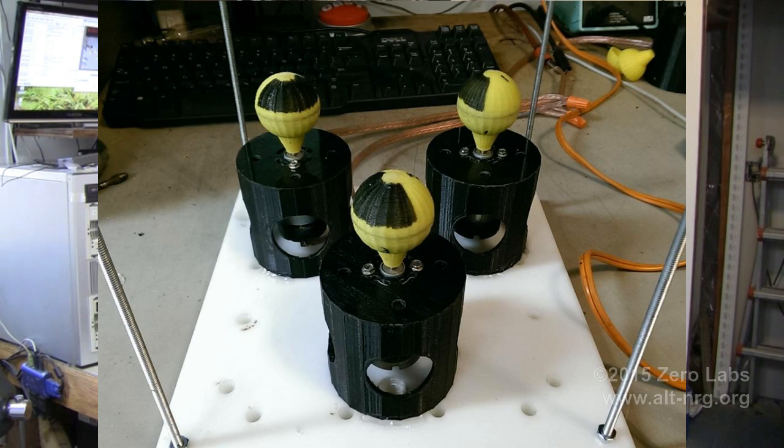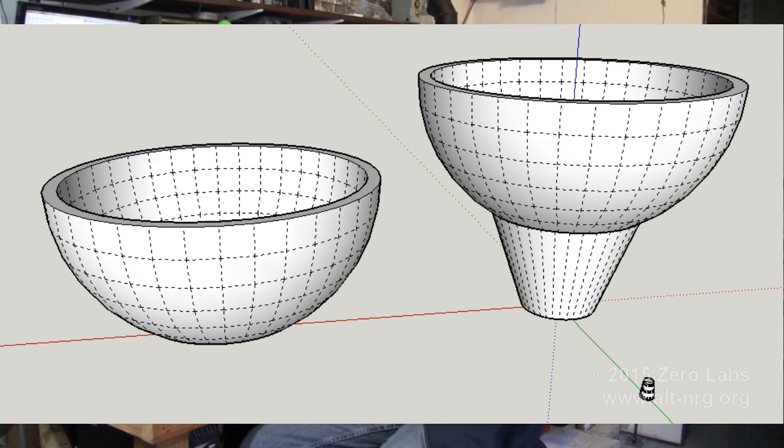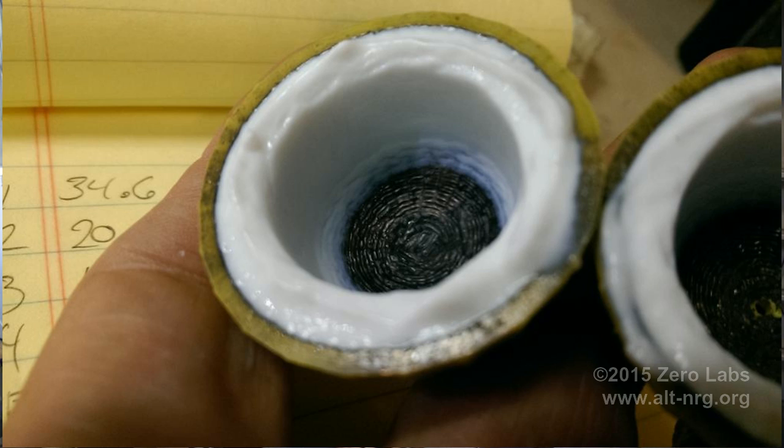Those of you who have been following my Twitter feed, joining us for the live broadcasts, and paying attention to the notes in the description that I've been posting on YouTube, you know that the mechanical assembly has been plagued with some mechanical failures lately. The way that the plasma reactor balls were printed was rather simplistic — I just had the two surfaces coming together edge to edge, and it was very difficult to get a good seal on those. So under the force of the centripetal energy with the ball spinning, they would leak, and I can't have that.